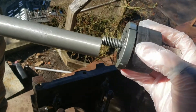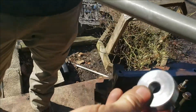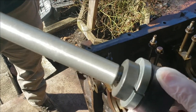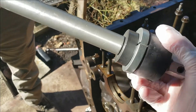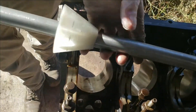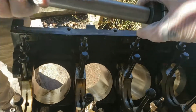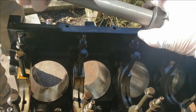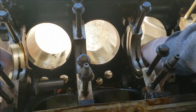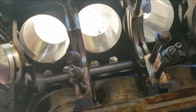This piece will go on to the end of your shaft here. Depending on the size of your bearing, you will need that driver to space it up. You usually have to set this down inside of the bore itself and feed it through to be able to press the bearings in. Let's go ahead and feed this down in here just like so — with the help of a helper to attach it — and try not to nick your new bearings you just put in.